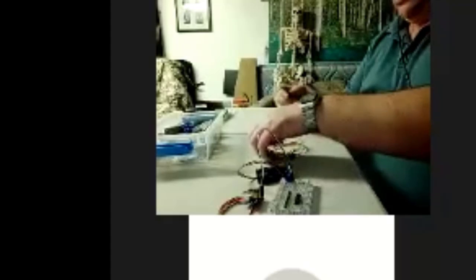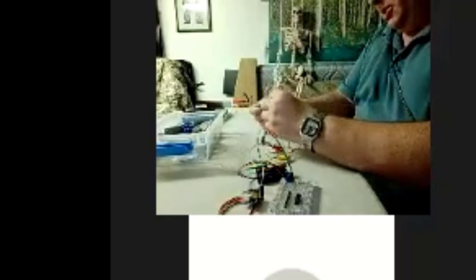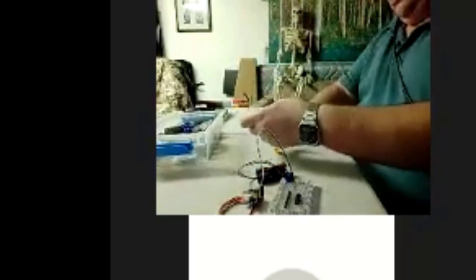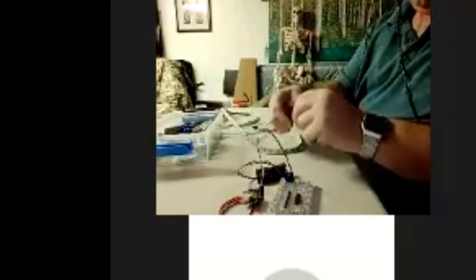Now that I have those three guys, and now they're male, I'll put my clips on them. Now my signal is yellow and my ground is green. And on the other end of these guys, be very careful with these. They're fragile and they're expensive, but they're amazing. If you don't have one of these types of miniature clips, you are doing it wrong. I'll fasten these to the ends of the LED adapter.